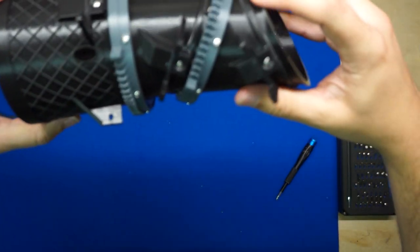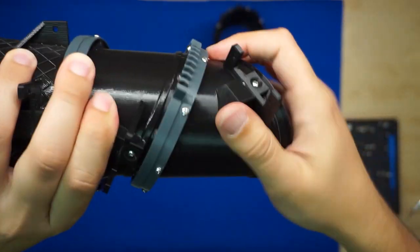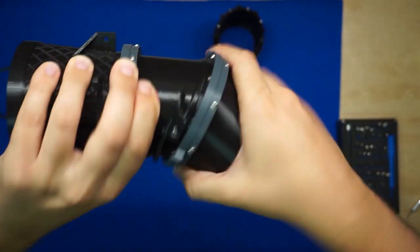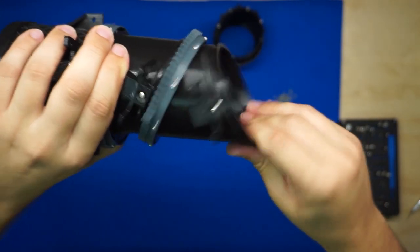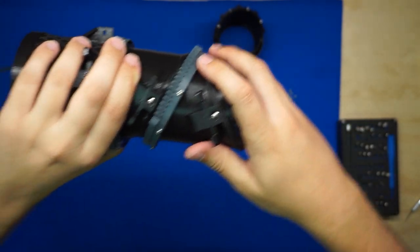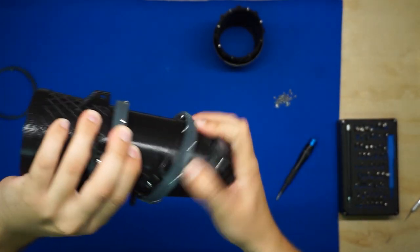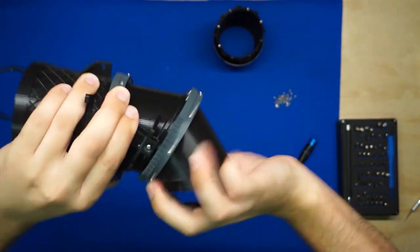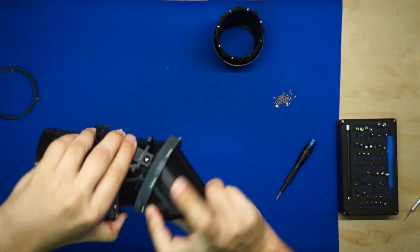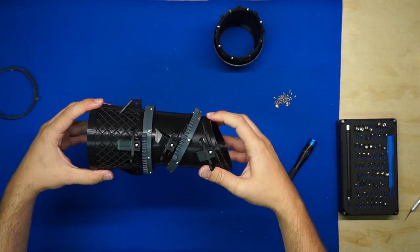All right, so we've got all our screws tightened down. We've got our servo mounts and gear stoppers aligned. This one's a little stiff, so what I'm going to do is just work it back and forth a handful of times until it loosens up. What's happening here is that the bearings, of course, are metal. They're harder than the 3D printed plastic flanges, so they'll just wear a little groove to ride in that will loosen up this motion. Okay, that's much better. So we'll move along to the last section.